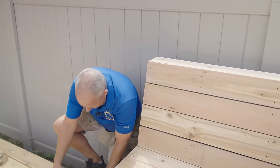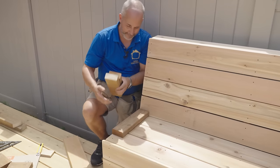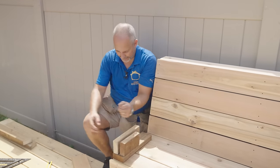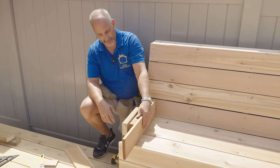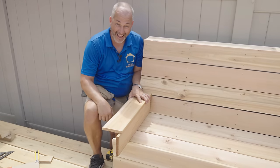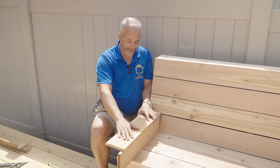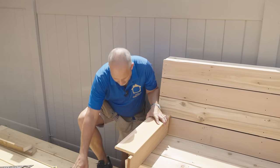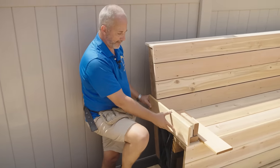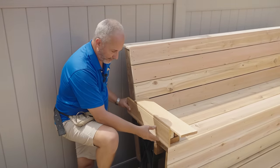So I came up with a plan. Basically, I'm gonna put a 2x4 right here, and then 2x4 is like this, right out to the front, okay? And then I'm gonna clad it in cedar, wrap it around, put a top cap on it, make an armrest. Not bad. That gives me 46 to the inside finished, and puts somewhere to put a drink on this other end of the bench. It'll also wrap around with that miter joint right off of here. Okay, perfect. And then I'll have this, and then we'll just do miter joint just like the end table.